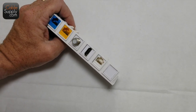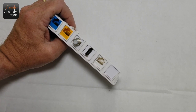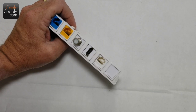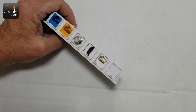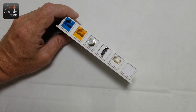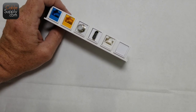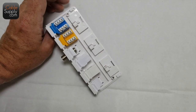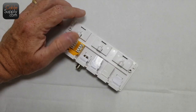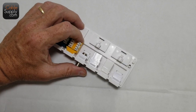This setup is very flexible. When you go with 24- or 48-port patch panels in a data rack or cabinet, you don't have that flexibility — it's going to be 48 ports of RJ45s. With this six-port surface mount box, you have multiple different types of connectors that can go in: RJ45 Ethernet, coax, HDMI, pass-throughs — you can mix and match however you need.